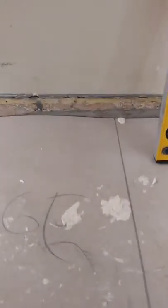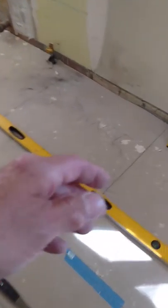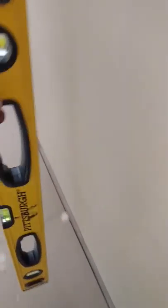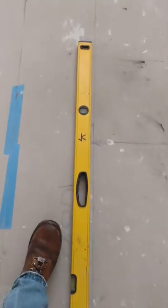Coming back over here, what I do is come out and measure the wall from the back to the front. This is the 24 inches, and then I snap lines on the floor. You can also use chalk lines if you want. After I draw out my lines for my bases, one thing you have to keep in mind is if your walls are out of level — that's going to change that line, so make sure you factor that in.